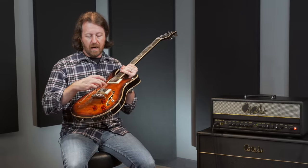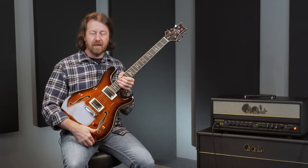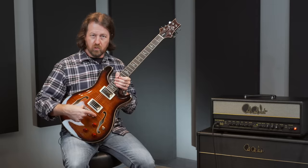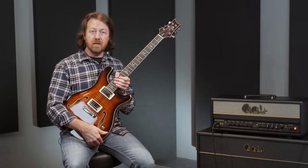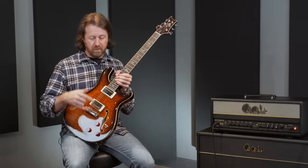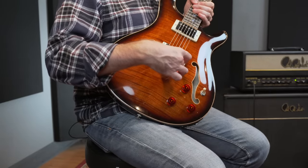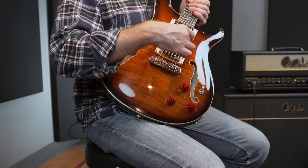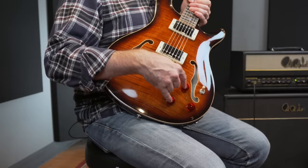The output closest to the strap button is the isolated magnetic output — in other words, the regular electric guitar pickups go directly to that. There is a battery in the guitar to power the preamp for the piezo elements, but it doesn't matter if the battery is in or dead; this will always work and always pass signal from the magnetic pickups. The other mix output will give you both the piezo and magnetic sounds out of one output if you so desire, and you use these independent volumes to dial in the mix.